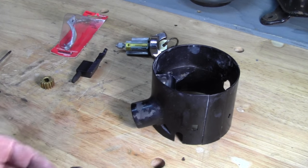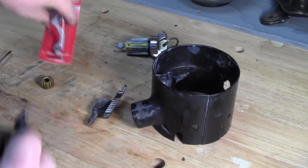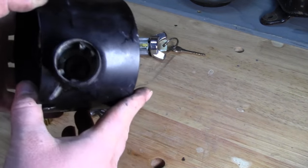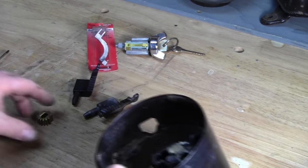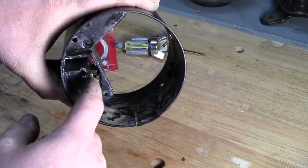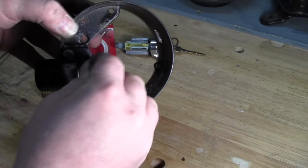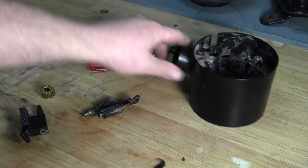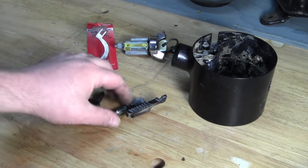And that's what I think my problem is. So I'm going to go deeper and replace this. There's a tiny little snap ring and a retainer down in there, and then that comes out and I can replace this part. I've got to finish cleaning up the housing. Well, it's probably usable, but I have both parts and I'm just going to replace it anyway — it's going to work a lot smoother. Then I'll grease everything up before I put it back together.